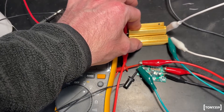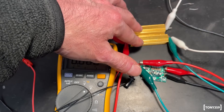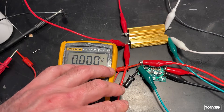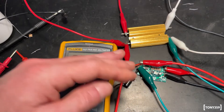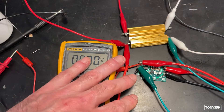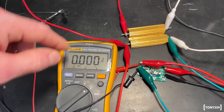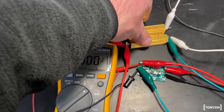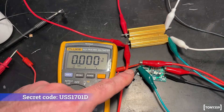I found two 8-ohm resistors paralleled to make a 4-ohm resistor. These are 100 watts, so there's plenty of headroom. I don't mean to burn the C64 Saver. I believe the C64 is rated 15 watts — though that probably includes the cassette tape and other things. At 4 ohms and 5.5V, which is roughly where the C64 Saver cuts the voltage, this resistor should draw about 8 watts, which feels reasonable and should be safe for the C64 Saver.